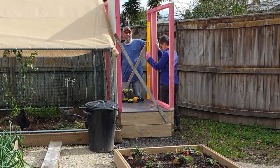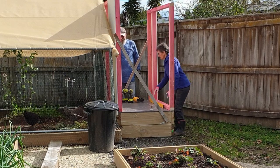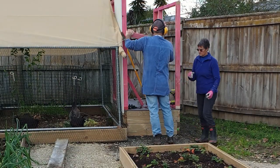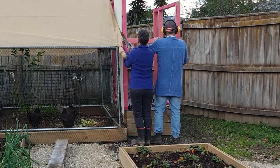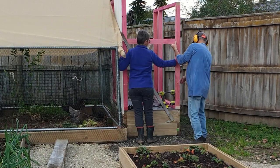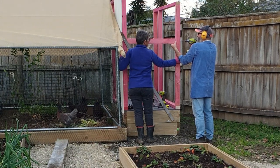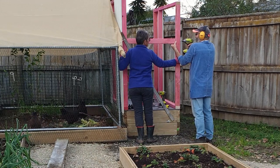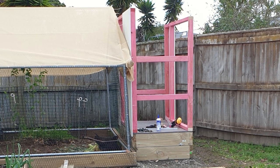Now the side walls already have their vertical framing, because the vertical framing on the north and south walls also serve as the vertical framing for the side walls. So all the side walls need is the horizontal framing, screwed between the uprights that are already in place. The horizontal framing provides strength, but they also serve another purpose.